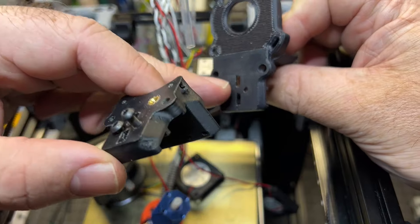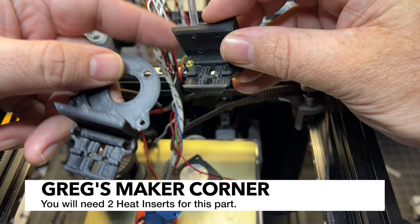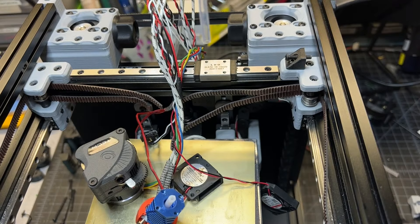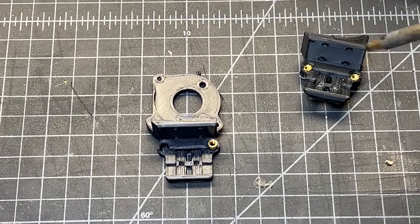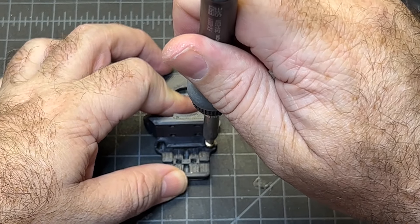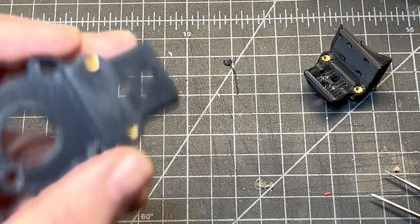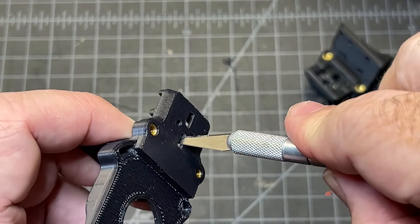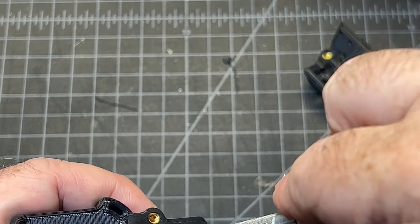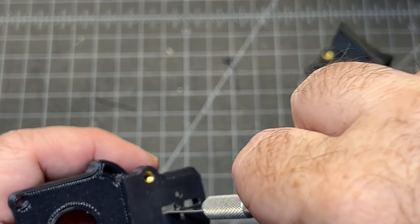The M3x6s are going to go into the same part — just keep that in mind. You're also going to need to put heat inserts in this part, mirroring what they are in the original part, and insert them to be flush with the edge. Something else I'll recommend: if your printer's pretty low to the Z, you might need to clean out your belt area just a little bit to make sure the belts are going to fit in there nice and easy.